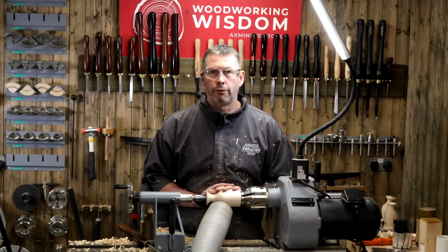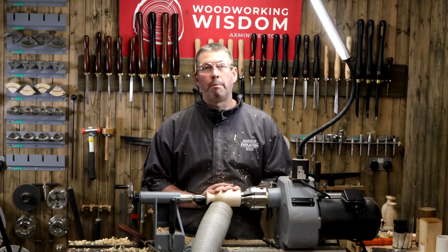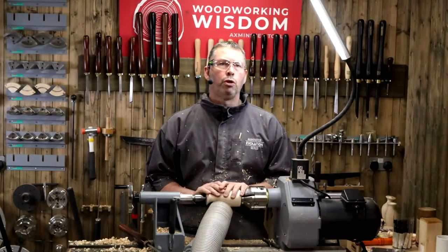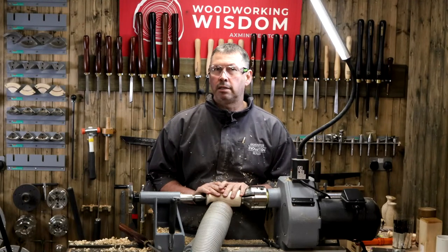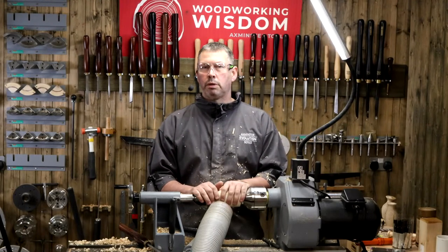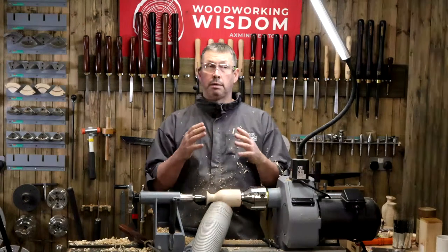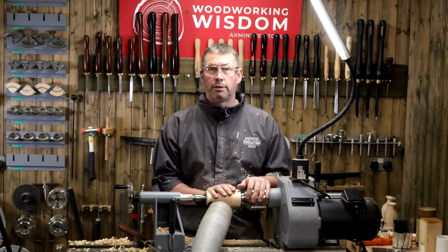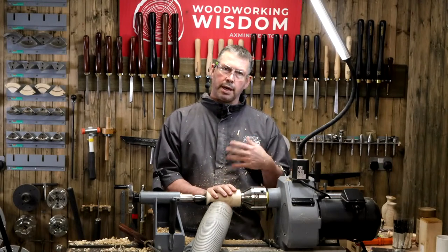That's the reason for things like beading and parting tools being there. They're much less of an angle. So you compromise finish for ease of use. And that's what we're doing with my skews. I'm tending to put a 25 degree bevel angle on instead of that harsh 15. Some of the standards, again, same thing.